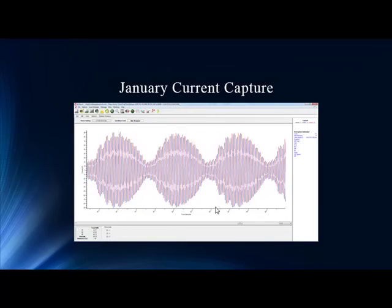What alerted the technician was that process personnel were saying they were having significant current swings and asked them to come take a look. Sometimes operators are your best indication — they say something weird is going on. They may not know exactly how this motor works, but when they see that meter varying back and forth — in this case varying by about 70 amps — it makes sense now why that pole-pass frequency was approaching line frequency. This is almost going from no load to full load multiple times in a second.